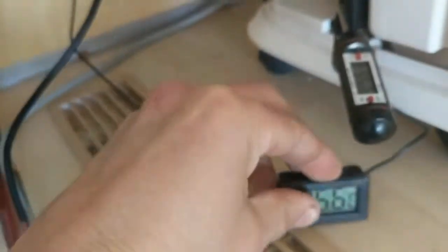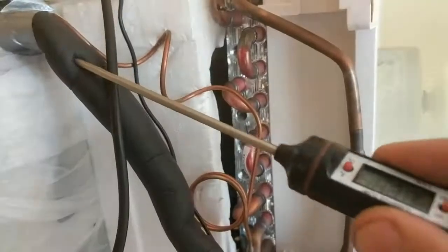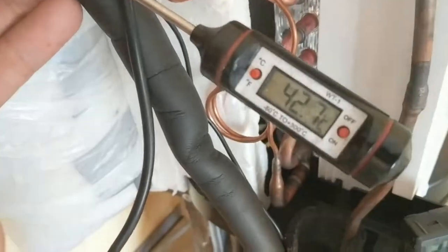The cooler evaporator had gotten frozen before, but now you can see 30 degrees coming in and the water temperature is 25. The problem is the compressor - it gets too hot and a security protection shuts it off. You can see the compressor temperature here: with about 20 degrees Celsius of gas already going into the compressor, it really heats up and becomes too hot to touch.